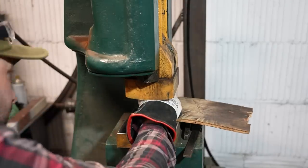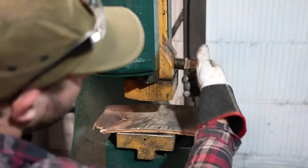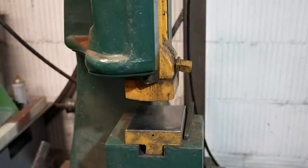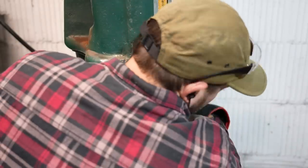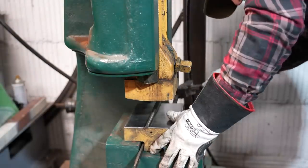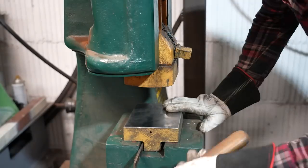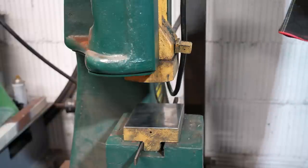It's a great practical application for those pads and left things looking super nice. Now it was just a matter of putting the dies back in the hammer — the bottom die sitting in the dovetail, the top die bolted in with those two bolts including the one that's pretty much broken. You can see how nice the bottom die looks. The size might not be perfect but I think they're going to work really well. The bottom die is wider in every direction than the top die, which could be problematic for longer stock. Also, removing imperfections from the dies keeps them out of any material I hit — having them glass smooth is going to be really helpful.